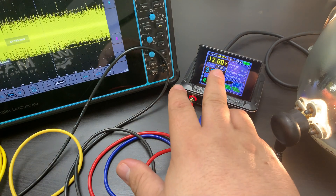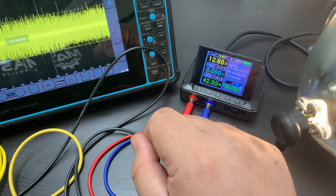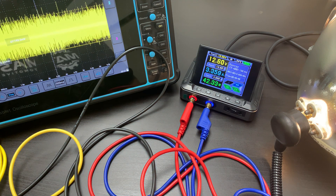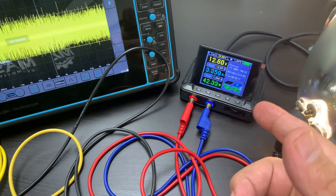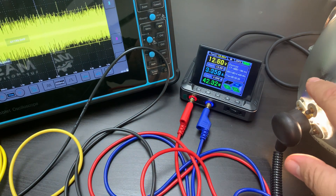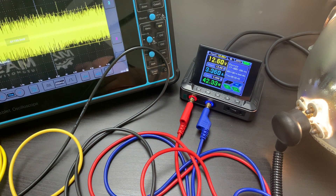So if you are going to be trying to use this power supply for something that needs to be very precise — like you're doing bench programming — this might be something you would want to verify before you use it, because that ripple is excessively high. I've learned this from a good friend of mine who's an electronics engineer: in computer applications, over 50 millivolts can lead to a module misinterpreting information because of the actual ripple. For me, if I was going to be using this in the shop for bench computer modules and stuff like that, I would want to figure out a way to increase the capacitance, so we can clear some of this up — specifically when it's under a load. This ripple is going to be something I'll keep in consideration any time I'm using this power supply.